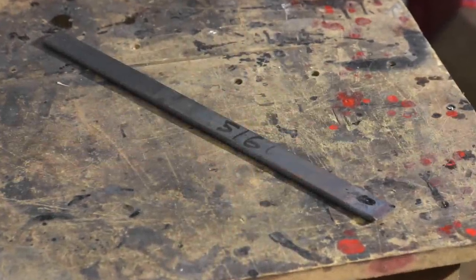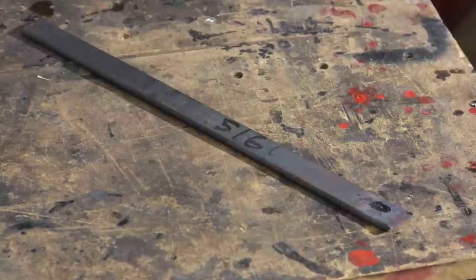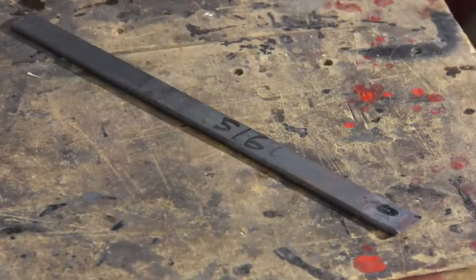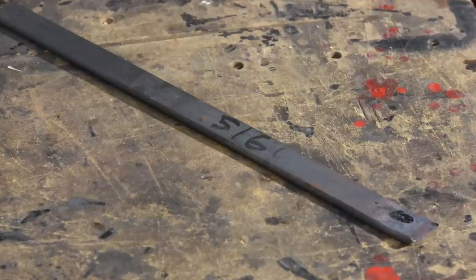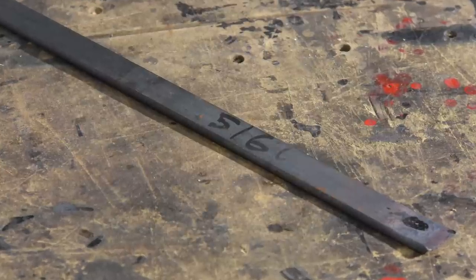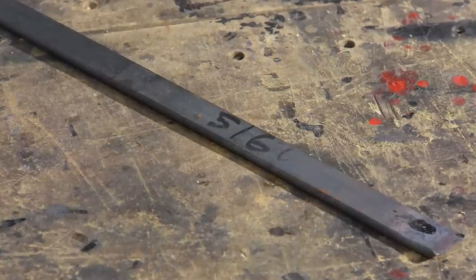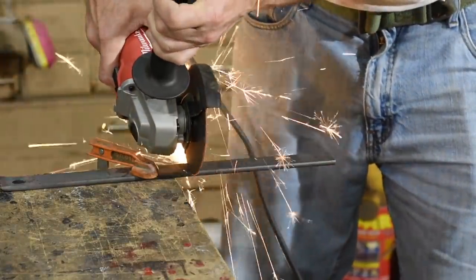For this project, we'll be using a steel called 5160. It's a sort of medium to high carbon steel with a pinch of chromium. It doesn't hold an edge especially well, but it's quite shock resistant and relatively easy to heat treat, making it ideal for a homemade throwing knife. I bought this from Admiral Steel probably about 15 years ago.